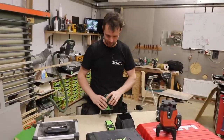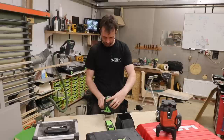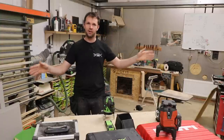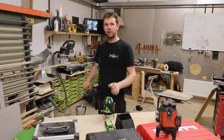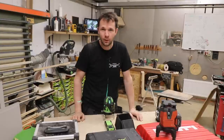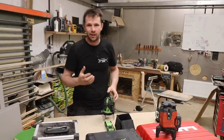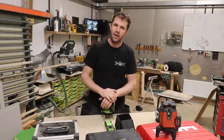Hopefully that has made sense. To quickly recap: go into the room and ascertain where you want the front of your furniture to sit, then place your laser level so one of the vertical lines sits perfectly on that plane and mark the cross position on the walls — preferably top, bottom, and middle. Extend that line out through the room and reposition the laser further away from the furniture, casting it back into the space perfectly square to the face frame position. Then use those lines to measure all the walls and everything about the project. There's going to be another video on how to take those measurements, put them into Google SketchUp, and do a very simple drawing that makes your life really easy when it comes to making that piece of furniture.